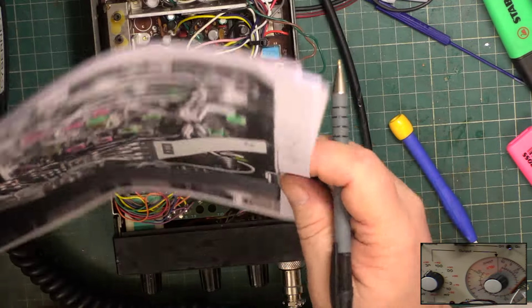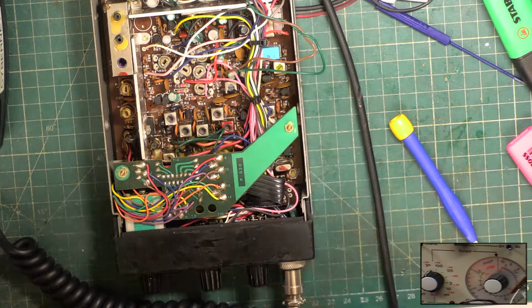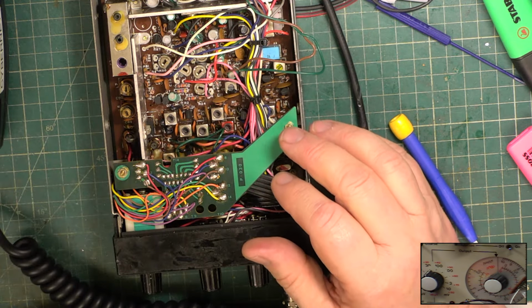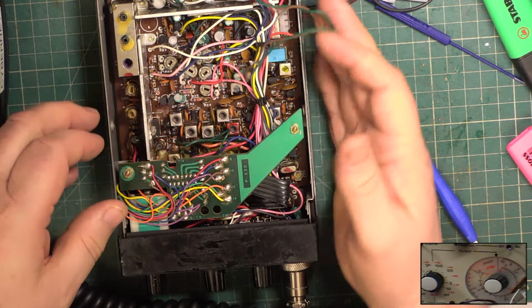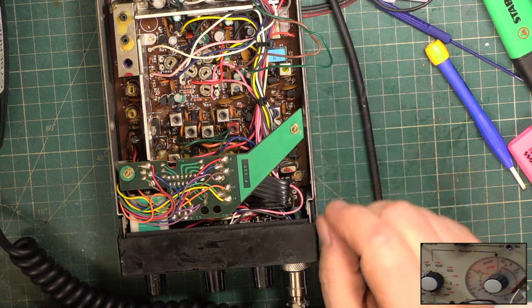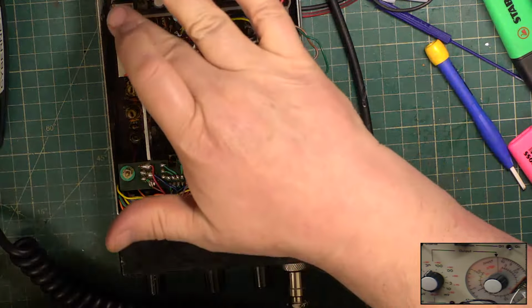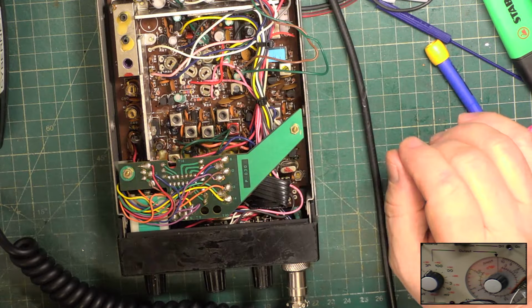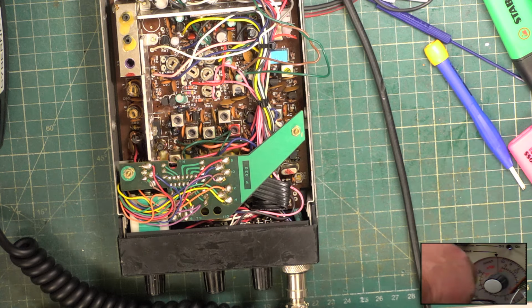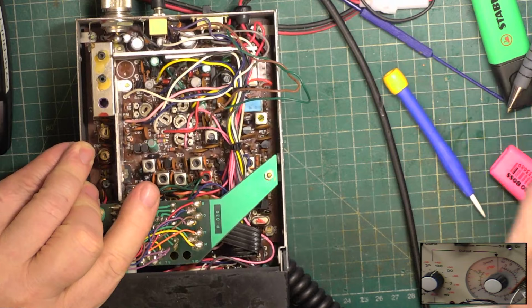Go. You know, it's taken me 40 years to do these photos. So we're not going to do the VCO. We'd have to work a method out. I do have that one that Mr. Benefactor Allen sent in. Whether or not it is repairable is another matter. I've certainly had a look at it and not got anywhere with the VCO in 90 minutes, so we'll see. But at least it's proved useful in proving whether this had the missing parts or not, and having the other scrap set did show that we've got what should be missing, so that's good. 2SC2078 is the output transistor, so I think we're all done. We've got the S meter to set with 100 microvolts on the test set, so an S9 equivalent. We need to adjust the S meter for S9, and then we're done.